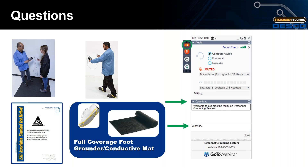To clarify on testing combinations: if you have three types of foot grounders — a heel strap, a booty, and ESD shoes — and two types of floors such as epoxy in one area and floor tile in another, with operators moving between areas, that means you have a total of six different tests to conduct. That's why limiting the number of products used for the flooring and footwear system can be so important.